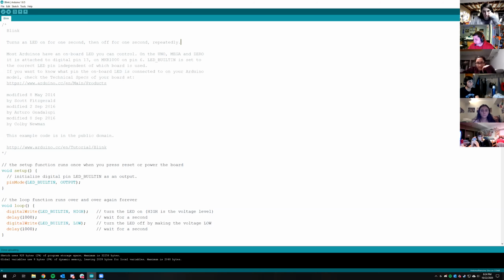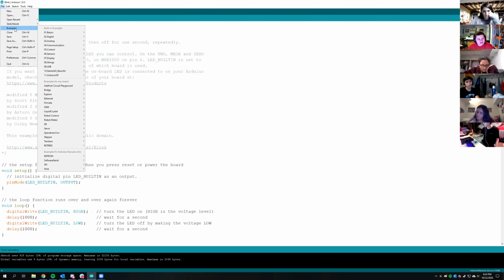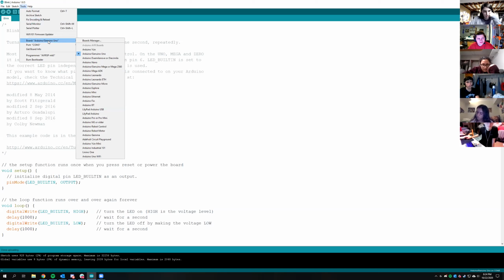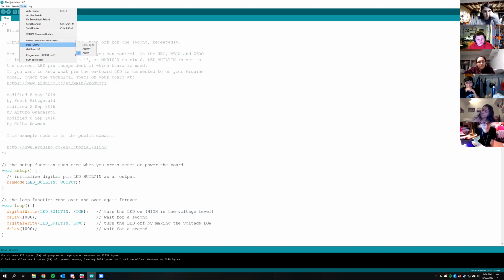Okay, Quinn. So once you get into Arduino, go to File, and then Examples, and then Basics, Blink. And then go to Tools and Board, and click Arduino Uno, and then Port, and click whatever the highest number COM port is.